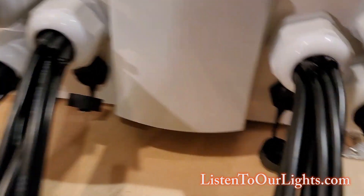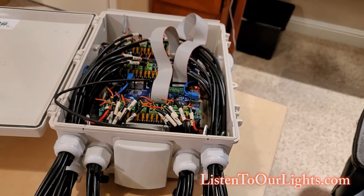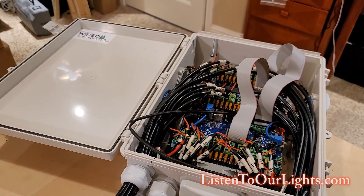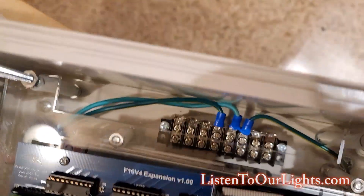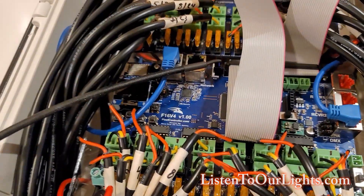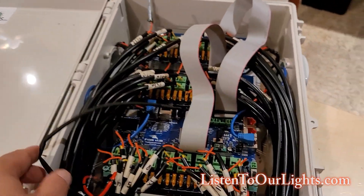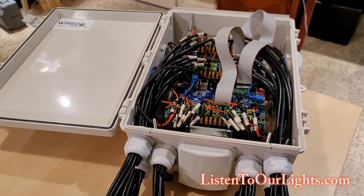Underneath I've got glands for the Ethernet — I use one for Ethernet and the other one for DMX. I run those through surge protectors, which go to a common ground as well as the power supply off that bus bar back there. And of course I got the Ethernet cables with the right-angled sides.